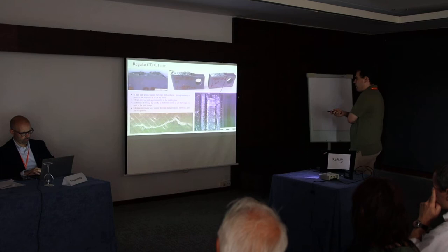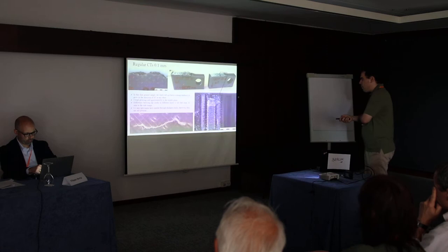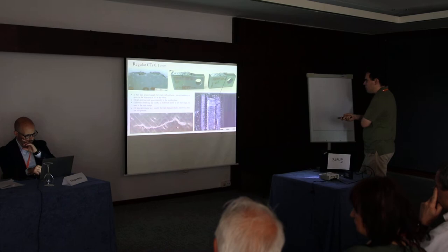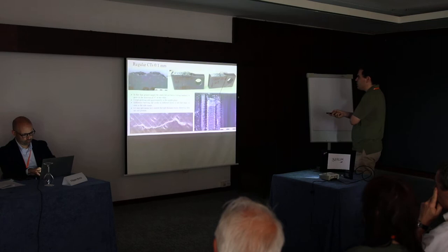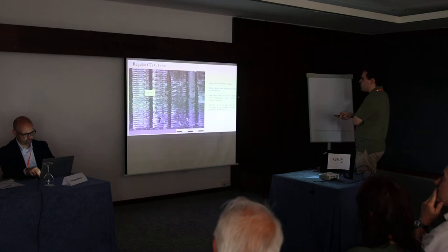And in 0.1 specimens, on the fracture surface we see that these through-thickness holes are quite a bit smaller. And with crack growth in these specimens, only one primary crack developed. So we didn't have any issues as we had with specimens with higher thickness. Then on the final fracture surface, we see the lighter region, which represents brittle fracture. So the final fracture is here.